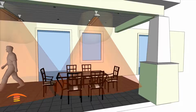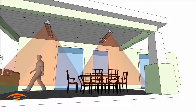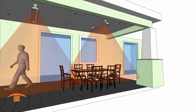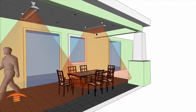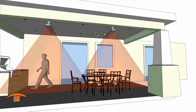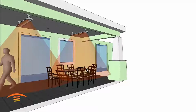In any case, that's the footprint of heat that you would get with that 9.5 feet distance apart. These are 4,000 watt units at 240 volts. We're hitting the area fairly well, but the heater itself is at the threshold of potentially being a little bit hotter of a unit. If you're going to consider using a control system, and you had the power available, I would definitely consider using a 6,000 watt unit. That way you can put them on two different zones. You can have it, let's say, 75% here and 50% here, or however you choose to use it.